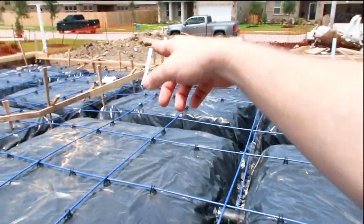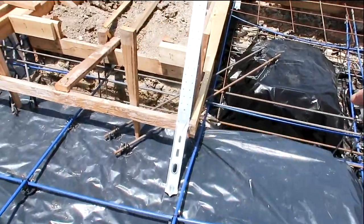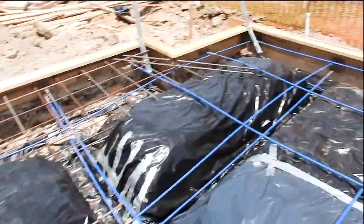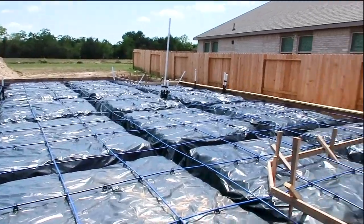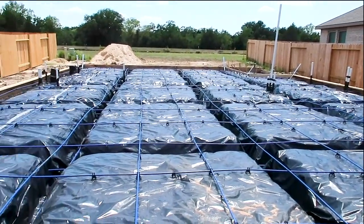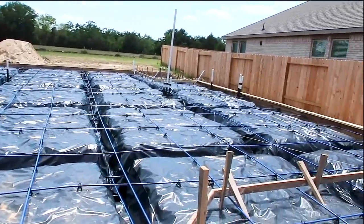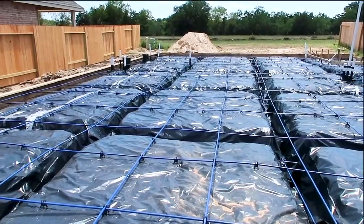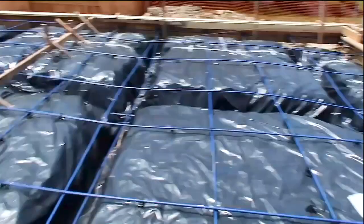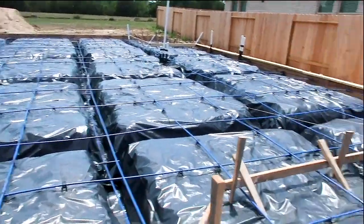He said there were some holes in the plastic over there. Typically you'll have rebar crossing over on the corners — they need chairs there as well. They really overkilled this small house, which is what you really want to see. The slab thickness is greater than five inches all the way across, and the beams are 18 inches wide and the proper depth. This is a really good-looking pre-pour inspection. Whenever you don't find anything, it is also peace of mind for your client. One more thing — a common call-out is around the exterior: they need some backfill before they pour the concrete.